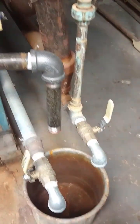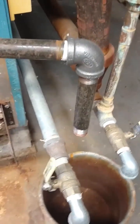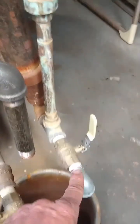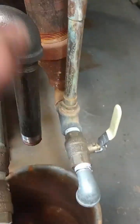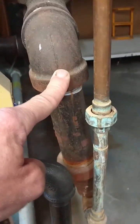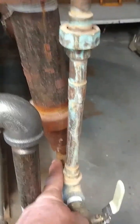Over here we have two other valves that also have to be drained. This valve here comes from behind the furnace, but it's just at the low point in the bottom of the furnace. This valve here is connected to this elbow right here, which is very small, and this is the return leg — the return leg coming from the house — and any sediment that comes from the house tends to collect in this little tiny fitting here.